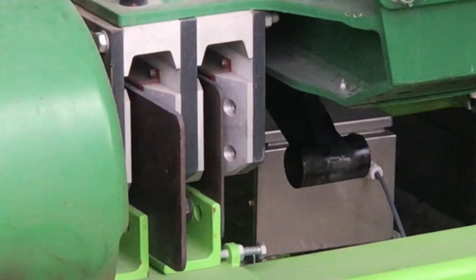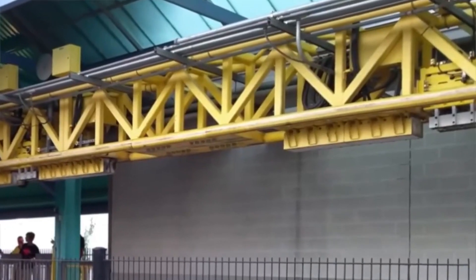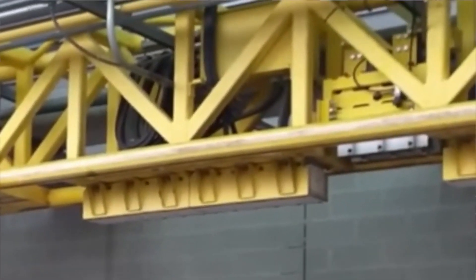There are two main styles of magnetic brakes. There are the type where the magnets are mounted on the train and the fins — the brake fins — are mounted onto the track. The other style has to do with LIM-style rides that use inductive launch, where those magnets are typically mounted on the track because the train already has the fins on them. The fins on the train are called reactive fins.